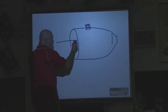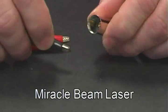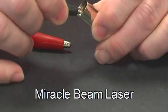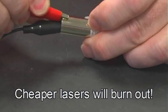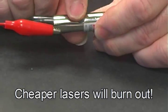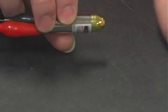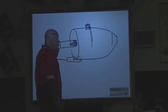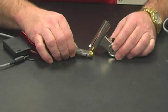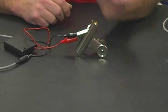The black alligator clip attaches to the spring inside, making sure that the edges of the alligator clip don't make electrical contact with the inside of the shell. The other alligator clip is attached to the casing. Then something is used to secure the on-off switch pressed down — I've taped it down, held it with wire ties, or in this case the bulldog clip. Find a way of turning the laser on and aiming it at the same time, and you're all set.